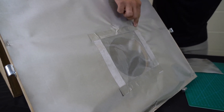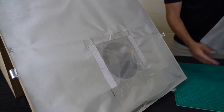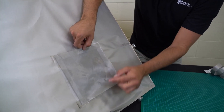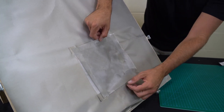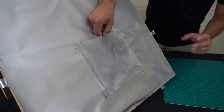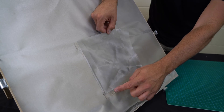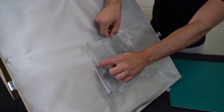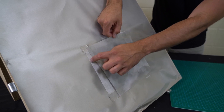We want to make sure that everything remains conductive. I'm going to do that with a second layer — you can see this layer is just a little bit bigger. What's nice about that is the tape will overlap further into the Titan RF fabric, making it like a second somewhat decoupled layer from the first one. It means it's not relying on the shielding of the first layer — it's actually allowing itself to be somewhat independent by connecting the transparent fabric to the Titan RF Faraday fabric that's exposed, not just the tape.